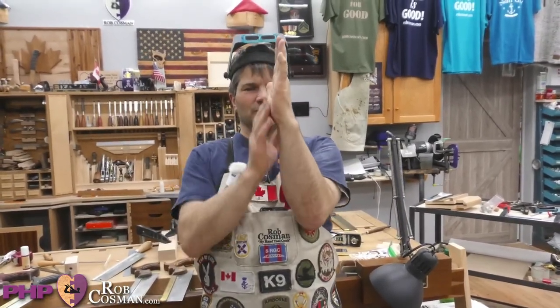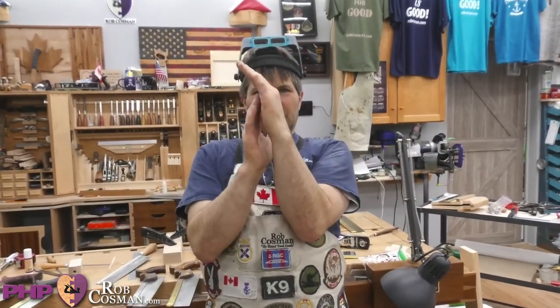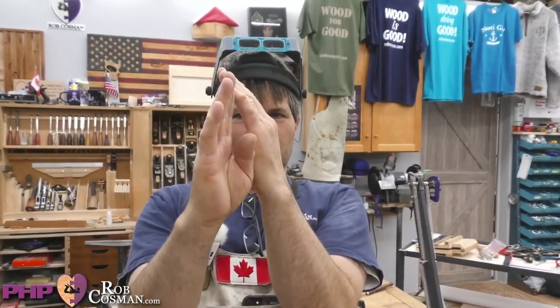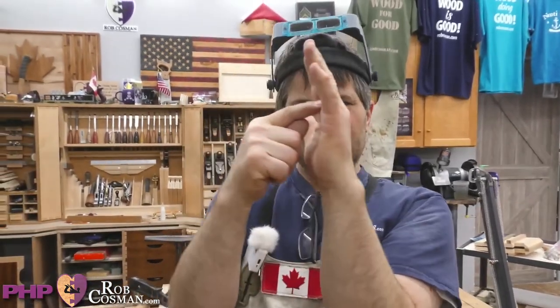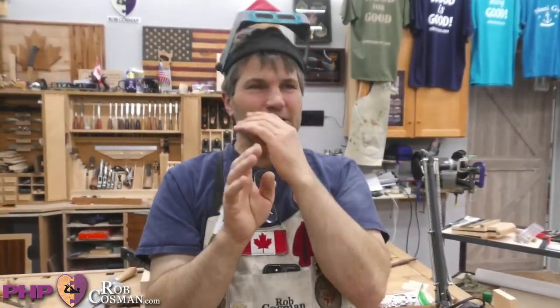If this is your saw plate, there's the base of your tooth, and there's your set. So we're 2 thou out here. Every time you sharpen, you're losing some, until eventually you've moved your gullet. The gullet is the base of the tooth. You've moved your gullet down into here, so you no longer have any set. Depending on how aggressive you sharpen, I would certainly say you'd be safe on 3 sharpenings before you have to worry about the set.